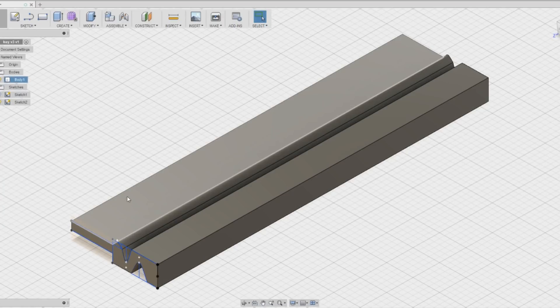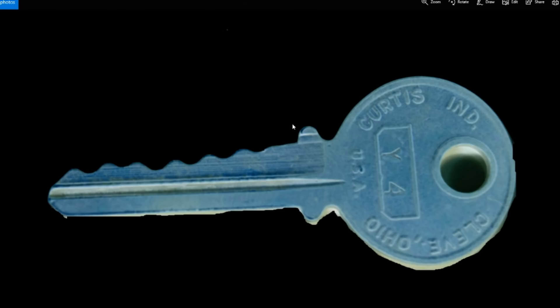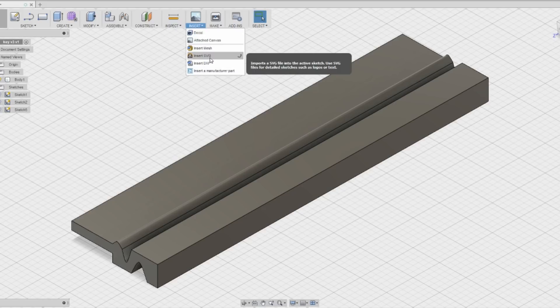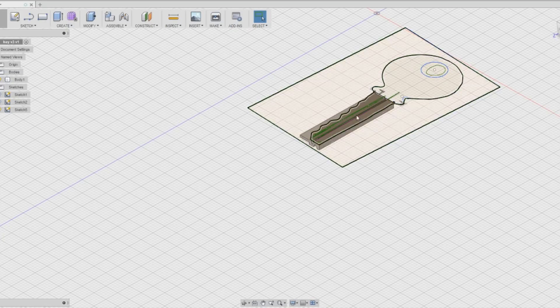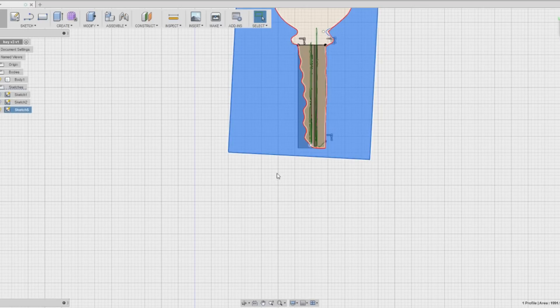The only thing left was to add the areas that lift the pins of the lock. I started modeling and sketching these out, but it was very tedious and time-consuming with a lot of different measurements. I decided there was a much better way: take a profile picture of the key showing each of the little risers that raise the pins, cut out the background, invert it, and convert it to an SVG file. I could then insert that SVG into a sketch in Fusion 360 using the insert SVG function — there are online converters for JPEGs or PNGs to SVGs. It was just a matter of scaling it down and transforming it to perfectly lay over the key blank. Once I had that, I could easily extrude away the extra material.